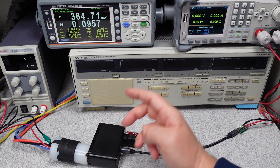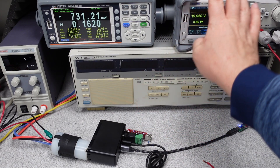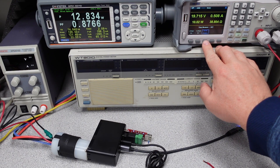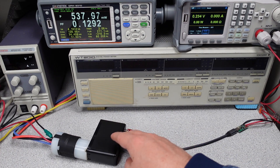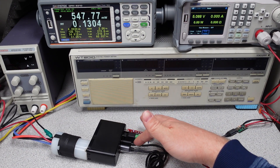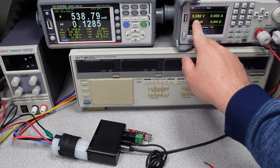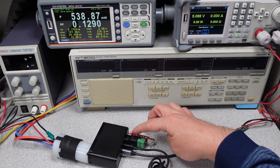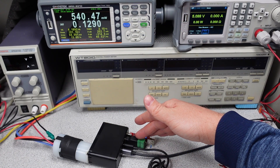We have a similar situation to what we've seen on previous power adapters. Right now I have three ports sitting at 20 volts and one port sitting at 5 volts, with effectively no load. I want to check the overload condition with all four ports plugged in. Starting to pull power from one port — at 10 watts, 25, 35, 40 — and it's off. With all ports plugged in, it looks like it can only deliver about 35 watts per port, which makes sense given the total budget. The USB-C ports reset to 5 volts, but the two USB-A ports did not reset — one is still holding 20 volts. We see that division where the USB-C ports operate a little independently from the USB-A ports.